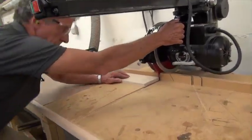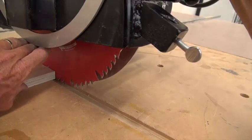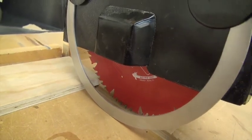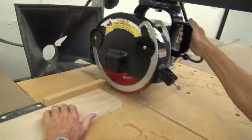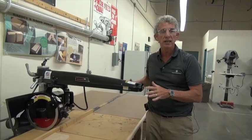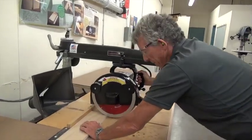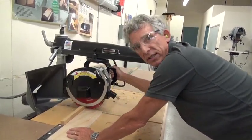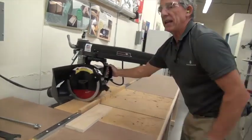If you go back and for whatever reason slide the board back, it's cutting in the reverse direction and it will throw the wood at you. And just like any machine, never talk to someone while using any machine. If I am cutting and I turn to talk, naturally I'm moving, my shoulder's moving, I will move the wood — this wood is going to fly at you. We never cut in the reverse direction.